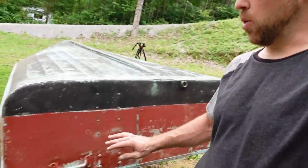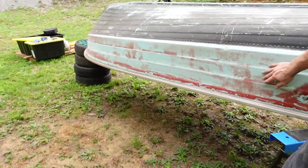Sanding the boat is a very good workout. I've done my 60-grit and my 220-grit — it's nice and smooth now. I've taken away any big chips off the side. I'm gonna grab a leaf blower, blow it clean of all the dust, give it a wipe off, and then I'm gonna use my spray paint.